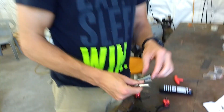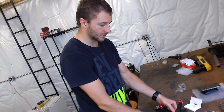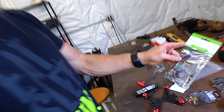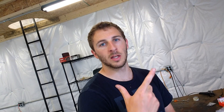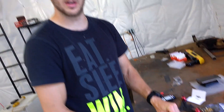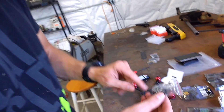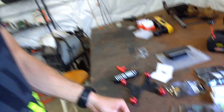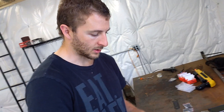We got our motors on all four of them. We're gonna take these off when we're done and get some Loctite. Now we're gonna take our speed controllers - we got a four-in-one speed controller on these quadcopters. It's a little different from RC planes where you only need one ESC. Here we have four different motors so we bought a four-in-one. You have a long screw with some spacers so we can stack the speed controller with our power distribution board and then our flight control board.